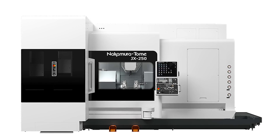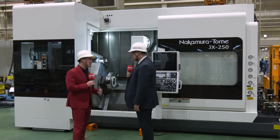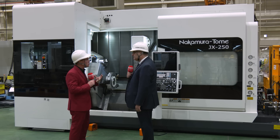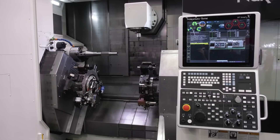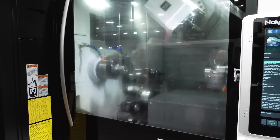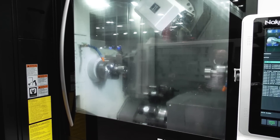Multitasking can lower cycle times, reduce the overall number of machines in a facility, get those one-off parts done within one machine, and reduce real estate. I want to focus on the smart cube specifically. As a former machinist who visits many shops, I often see the spindle head rotate only about 45 to 60 degrees — that's as far as it can go based on space. Or if there is enough space for a full 90-degree rotation, one side has to be pushed all the way over, which almost makes it useless, reducing you to two or even one tool in cut.